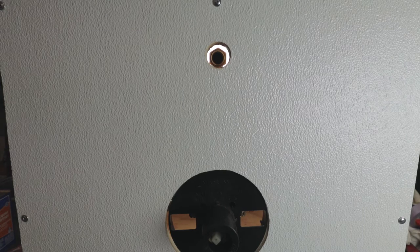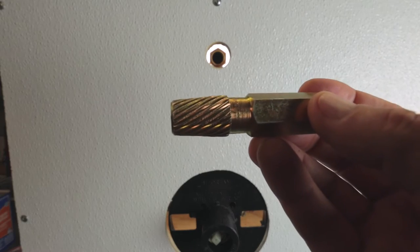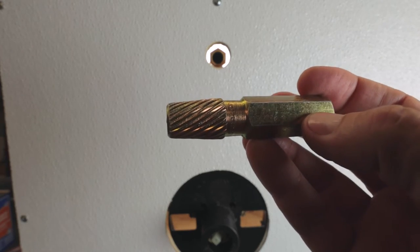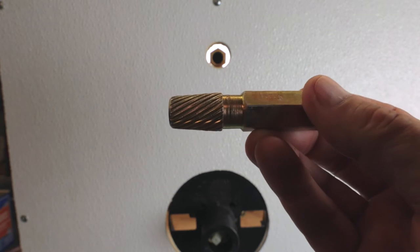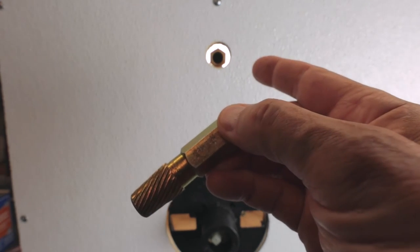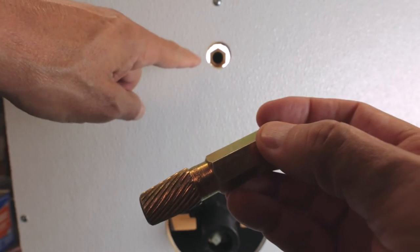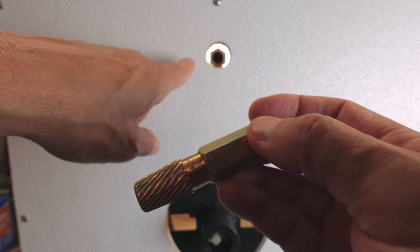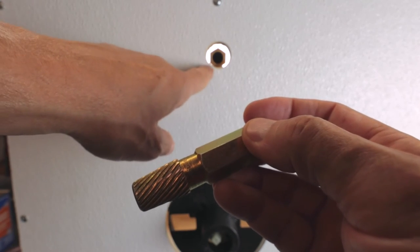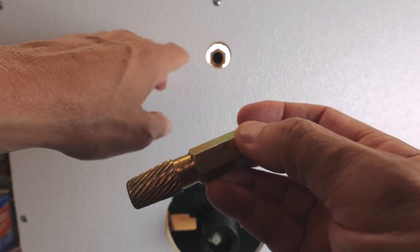The first tool is by a company called Superior, and this is specifically for removing the broken threads inside of that elbow. Now, one word of caution: when you do remove the old arm, if that piece behind the wall is not secured, I've been in situations where this piece is swapped off to the left or swapped off to the right because it was loose and not connected.